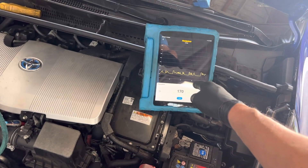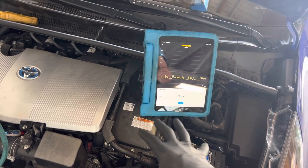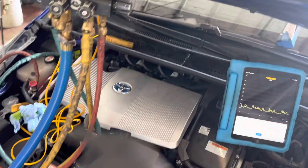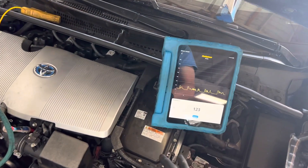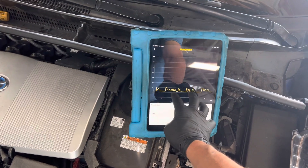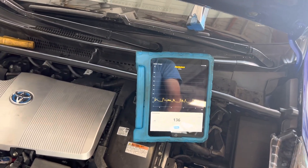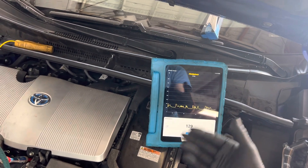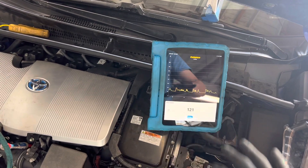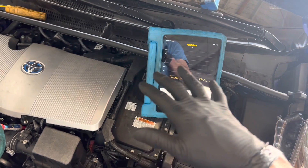We're doing the exact same thing. We have lowered the temperature at which the moisture can boil out of the oil, because we're using a vacuum pump — so it boils at a much lower temperature, and you're getting to witness this. As I'm talking, you're starting to see these gaps start to become longer, and it'll just progressively keep doing that.